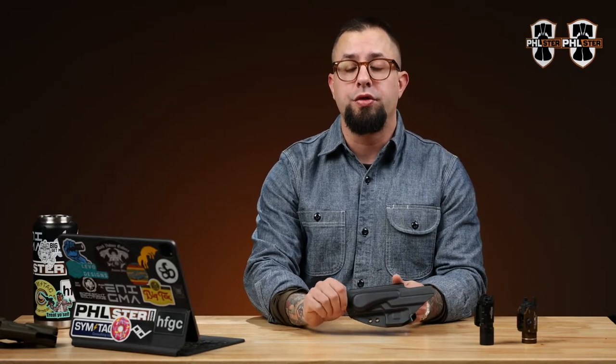So you see, the main reason that these holsters aren't shaped like bodies is because when you're manufacturing them out of something traditional like leather or kydex, you're starting with a flat sheet of material, which you then heat up in the case of kydex, or wet in the case of leather, and mold it around a positive shape. And that means that you're going to wind up with a final product that is the same on the outside as it is on the inside. So anywhere that we mold in a wedge into the holster, there's going to be a void on the inside. This is filled with nothing.